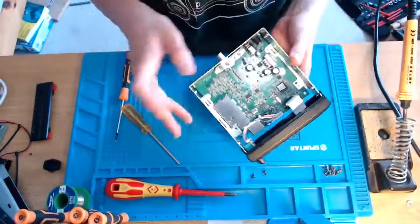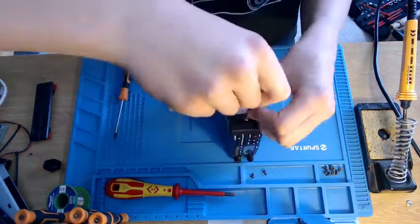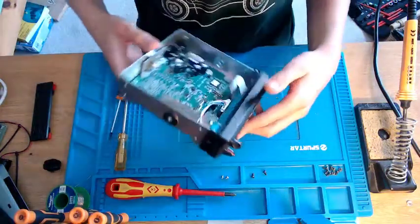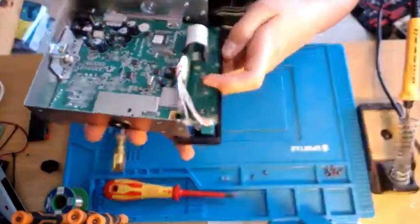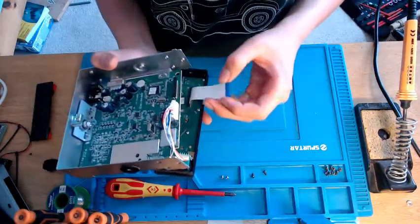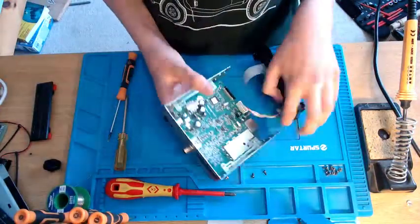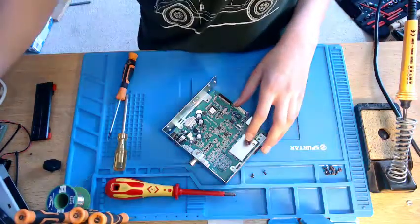Now you've got the scanner without a top or a bottom — just a chassis and circuit board, or motherboard I guess you'd call it. Now you're going to take out these two screws, one on this side and one on this side, and that's going to let the front control panel pull off. This ribbon cable here connects the screen and all the buttons, and this connector here does the knobs on the front — the potentiometers. That just comes off and is a unit in itself.